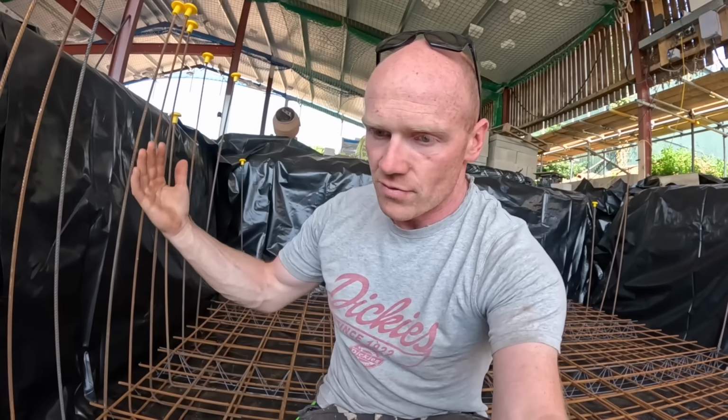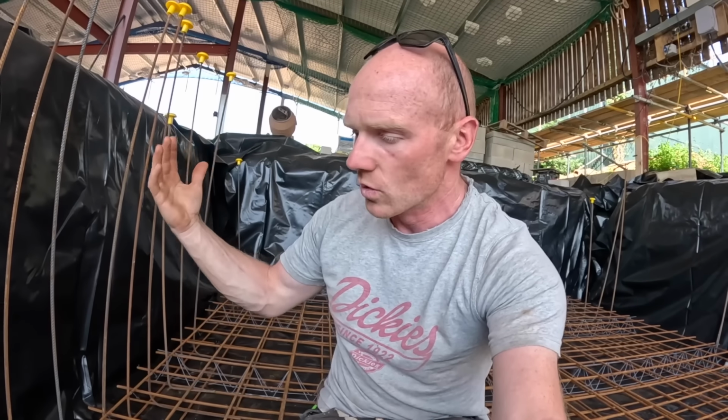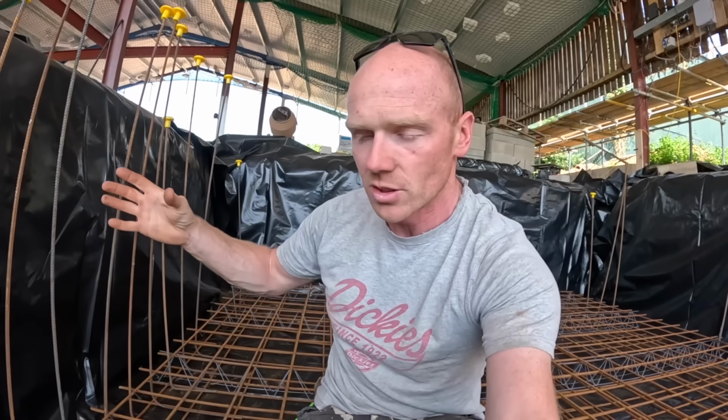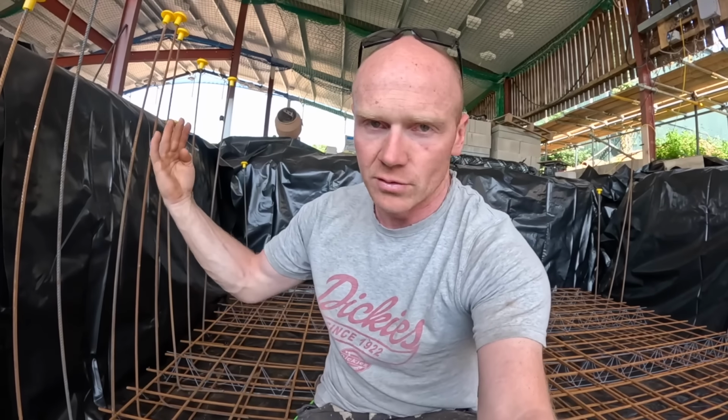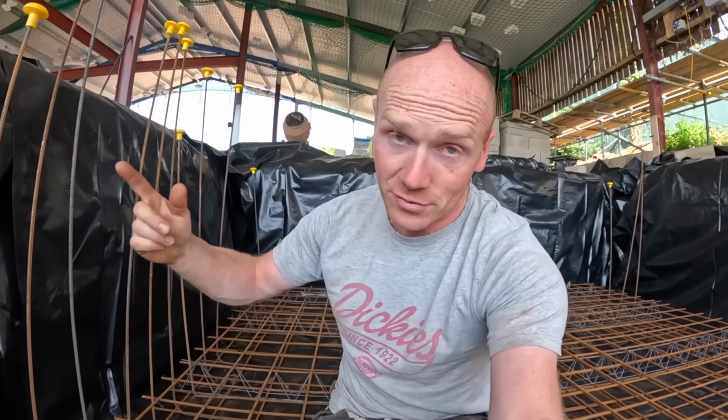And part of the retaining nature of that wall, in the core of the ICF, which are the insulated blocks that we're using, we need to have vertical steels. There'll also be horizontal steels as well. Fortunately, because the outside is fully backfilled, we've just got one single row of steelwork on three walls. The other end is even more steel.